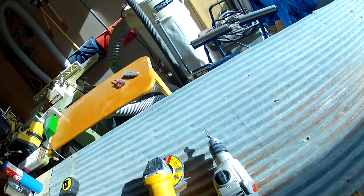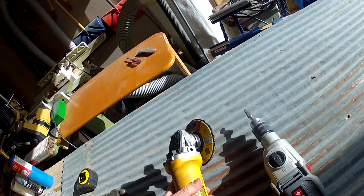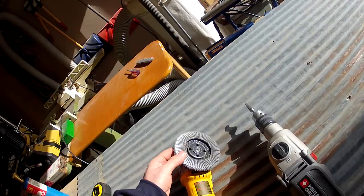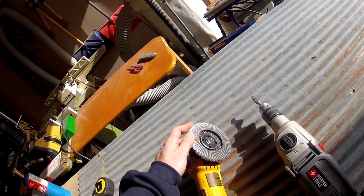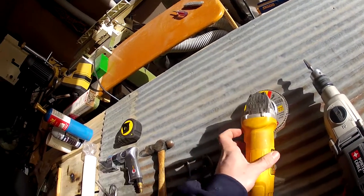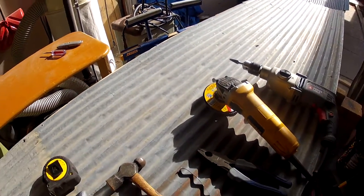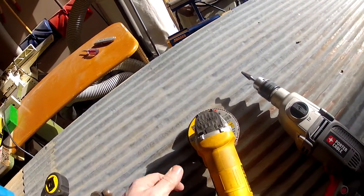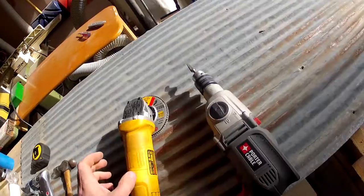For the cleaning process I use two different tools. I use this DeWalt — it's got a sandpaper head on it right now. This one doesn't rough up the metal that much, but it does take the galvanized finish off so it'll get me down to the tin. I found that head works better with this uneven surface because you're able to push on it hard and get it down into some of the cracks that something else won't reach.